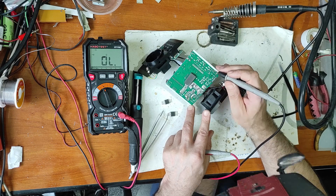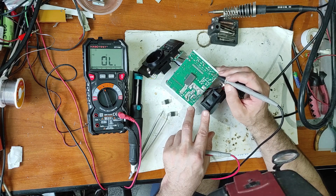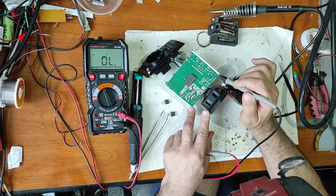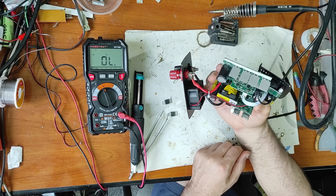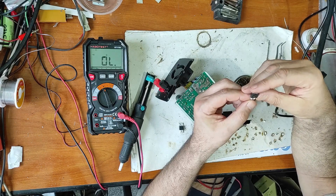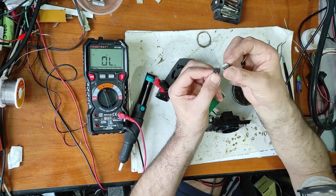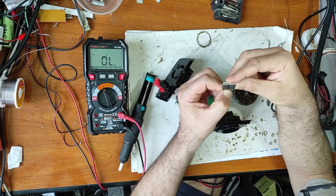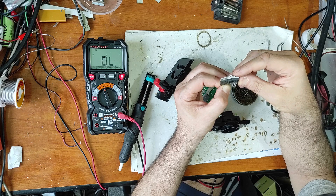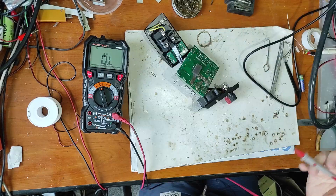I will interrupt this circuit because in the first stage I want to repair this half, and after that I will repair the second half. You can see this wire - it's a shunt, I believe it's measuring the output current. Here we have 23 amp, 100 volt MOSFETs. Instead of those, I will put 80 amp, 100 volt MOSFETs and replace both of them.